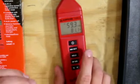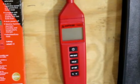Let's go over some specs and notes. If the meter gets out of spec for humidity — meaning you think the humidity measurement is wrong — sometimes the sensor gets too dry for a prolonged period of time. To fix this, put it in an environment between 20 and 30 degrees Celsius (68 to 86 degrees Fahrenheit) with 75% relative humidity or higher, and leave it there for 12 hours. That tip was in the instruction manual.